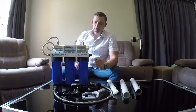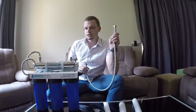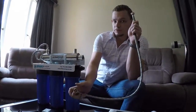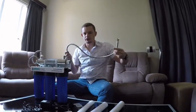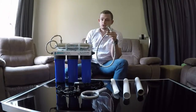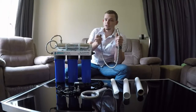What you can do now is check the system for leaks. This system is designed to fit under a basin, with one end attached to the faucet and the other attached to the wall where you'd typically have a valve. This is a half inch flexible hose. Close the valve and disconnect the hose from the wall, then check if the hose you have under there is still nice and flexible. If they're in good condition they are very flexible, as it's a rubber hose with a braided cover. If it's hard to bend, rather get a new hose, because it might be brittle and have a good chance to leak, and the sealing surface might already be hard, making it difficult to get a good seal on the system.